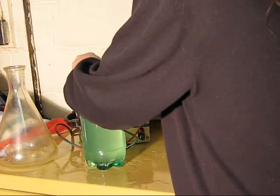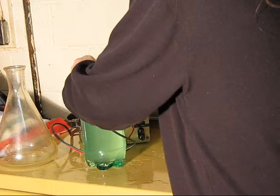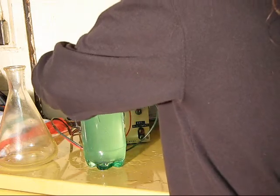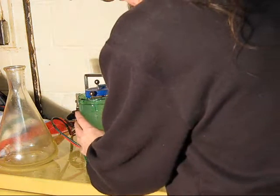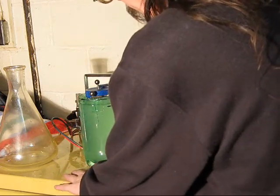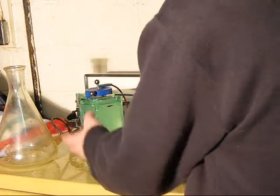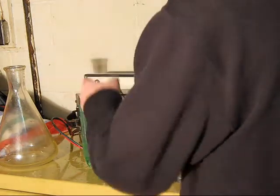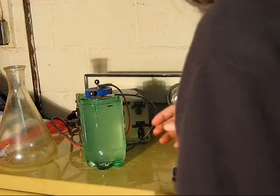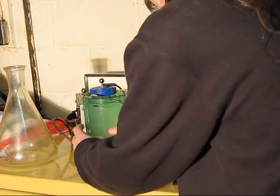So I'm going to connect the high voltage positive to this terminal, assuming it will stay, and ground to the outside, which you would typically want to do because you don't want a high potential between this plate, that is this outside salt water, and your ground. It's just pointless. Unless, of course, you have another larger bottle of some sort around that, and then you could make layers and layers of it and add a heck of a lot of capacitance. So, that's it.